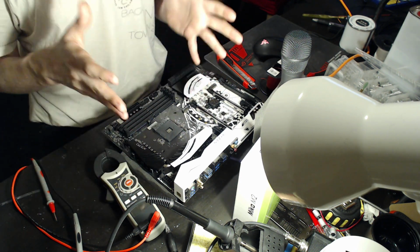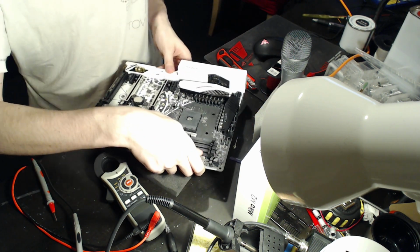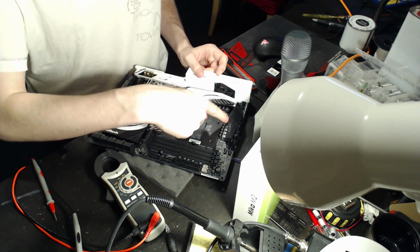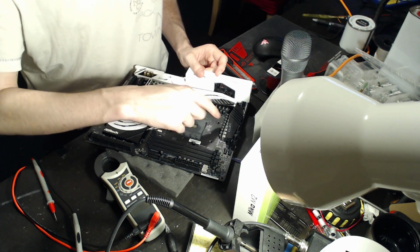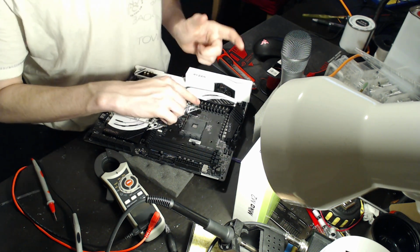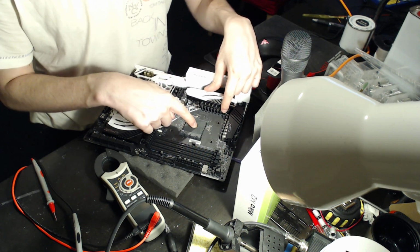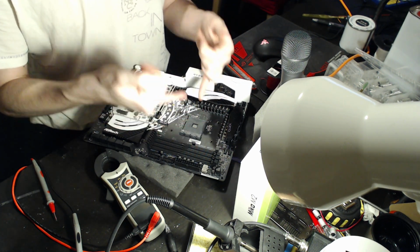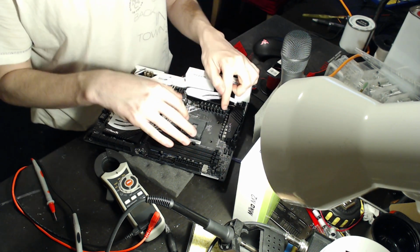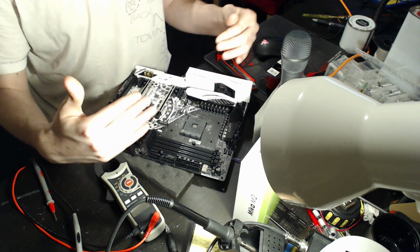Now, unfortunately, you can't read Vcore voltage off of this capacitor bank right here, because that's right after the output of the VRM. And your big problem is that this distance from the VRM to the CPU socket, and then through the socket, has some electrical resistance. Depending on how good your motherboard is, that resistance will be low or really high.